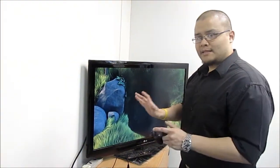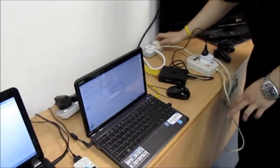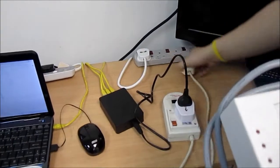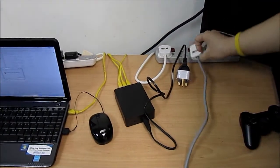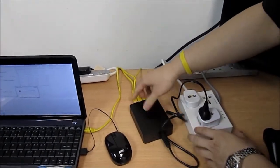I'm going to turn off the power supply to this station, stop this stream, turn off the LCD TV, turn off power supply to all interconnected equipment and the cell phone charger, and turn off power supply to the WD Live Wire. Now we're going to introduce Powerline Ace. This is one of the Powerline Ace models we have — it is also a performance-proven lightning isolator and surge protection device. I'm going to remove the common SPD, introduce the Powerline Ace and plug it into the strip. WD Live Wire plugs into the Powerline Ace, and interconnected equipment plugs into the Powerline Ace as well.